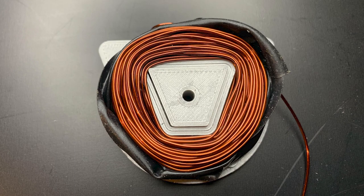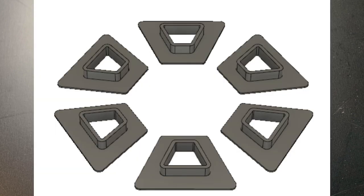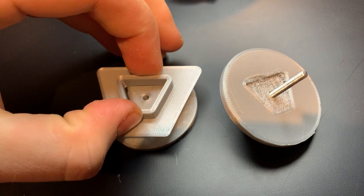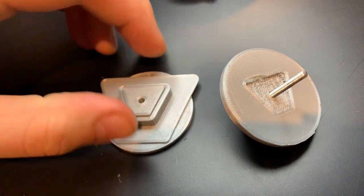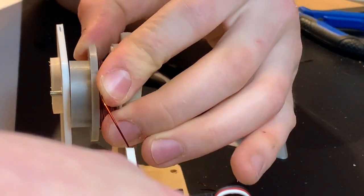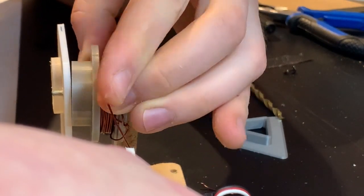Winding a couple test coils, I realized that the only way to have a consistent shape, and thus consistent phase voltage, was to make each coil around a uniform coil skeleton. The procedure for winding a coil was as follows. First, I would mount the coil skeleton on the coil winding mechanism. Next, 21 gauge wire was placed on the spool holder and clamped to the desk.